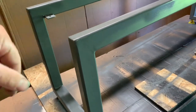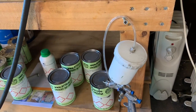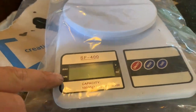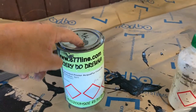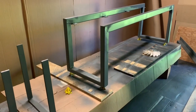Last time you saw me using this stuff we did a roller, but now we've got the spray gun working. Rob delivered it as a turnkey — all working, tested, plugged in, and that's it. You weigh it out at 20 parts using scales, same as I do with resin. This is the hardener and this is the primer. Tomorrow we'll do the top coat, which Rob mixed to match the primer color exactly, which is really helpful.